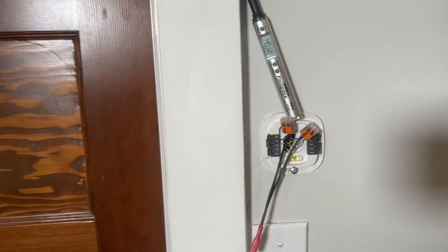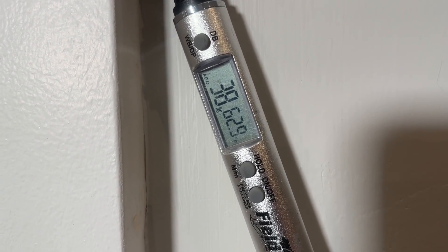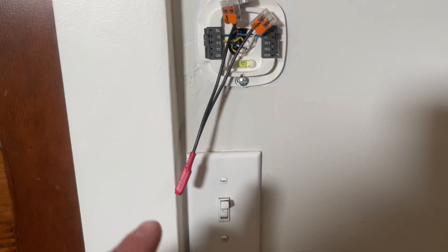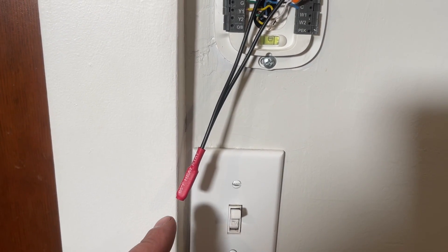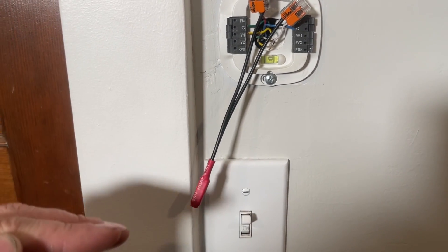So when we hooked this up we were at 64 degrees. We're going to wait for this to kick on. I've got my Fieldpiece thermometer here and the furnace just kicked on — it says it's about 63 degrees. So there's a two-degree differential. If it's 65 in here, this is a 65-degree heat stat — when it gets down to 63 that's when it'll come on, bump it up to 65, and then it'll wait until it gets down to 62 or 63 again.